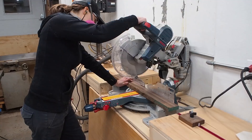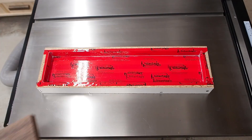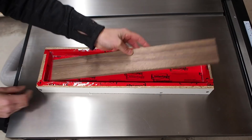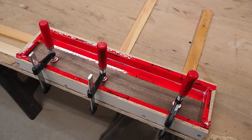I'm going to try a few different looks for the coasters, the first being walnut and white epoxy. My wood is just over half an inch thick at this point, aiming for a final coaster thickness of around three-eighths of an inch when all is said and done. I snuck up on the cut to get an exact fit for the mold, wanting to avoid leaving any gaps that the epoxy might get into. Before you mix up any resin, it's important to make sure your mold is level so you don't end up with a thick side and a thin side. I used a few shims to level out the form, and I also clamped down the wood so it wouldn't end up floating in the epoxy.